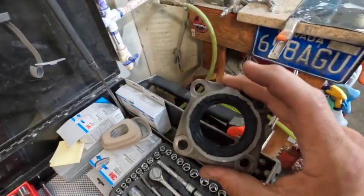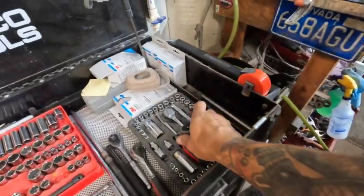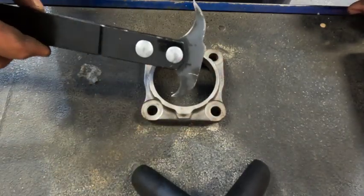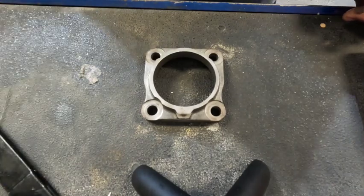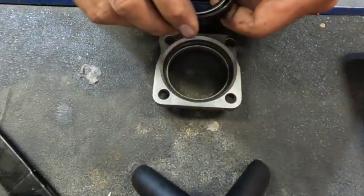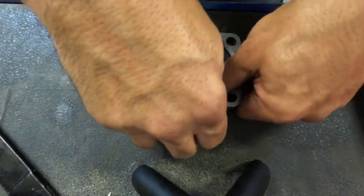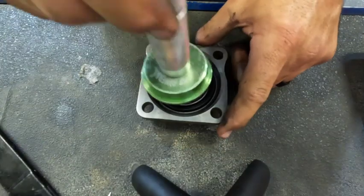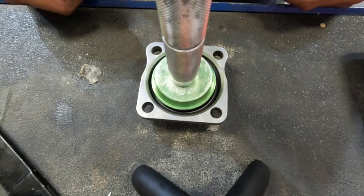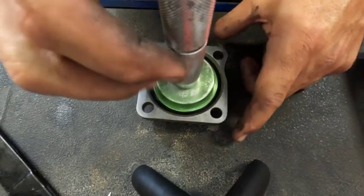Got all cleaned up, fresh out of the solvent tank. Now we'll be changing the seal. The old seal was removed - use a seal removing tool, be very careful not to gouge your edges as you're pulling that out. New seal here - you put them in from the bottom. I always get it started by hand first, and once I'm comfortable I'll take my seal installing tool and hit it with a hammer. You can tap it in, or press them in if you're equipped to do so.